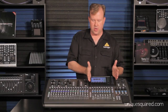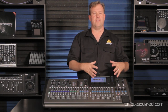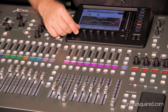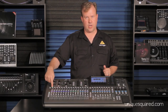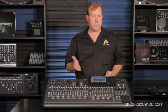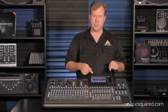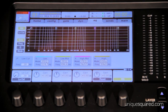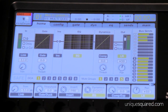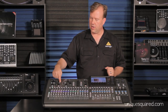What's really good about the screen here is that while there is one, it is not screen-driven — it's mixer board driven. You're the sound man; what are you doing? You can see that quickly on the screen. I want to adjust the equalizer of channel one — you don't have to paginate through a little screen. You simply select channel one, then hit View on the equalizer and you'll see the equalizer in full view to adjust. You're now adjusting EQs and mics; all you do is select subsequent channels and you're still viewing the equalizer. Same thing with the compressor and the gates — they all have View buttons. It calls up the parameters quickly. Whatever you're working on, there is a View button. That is one of the number one ease-of-use features of this mixing board.